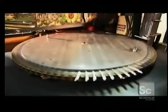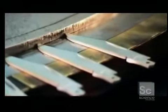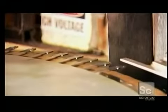A trip into a fiery furnace hardens the metal. It's the first step in heat treating the blades. Once they're cool, the blade shapes are placed on the magnetized rim of a rotating carousel. It moves the base of the blades under an induction heating coil. The heat anneals that end, making it pliable enough to bend and easier to fit in the pocket knife handle.